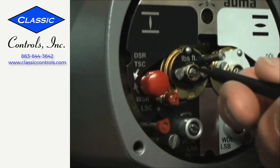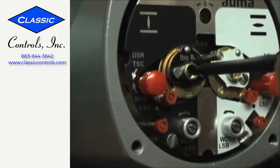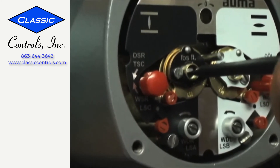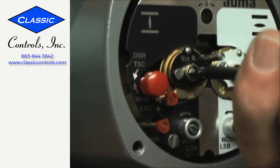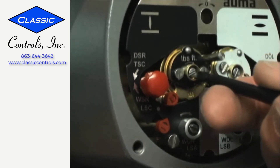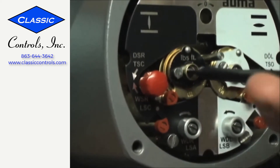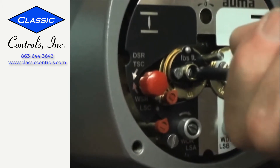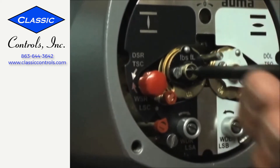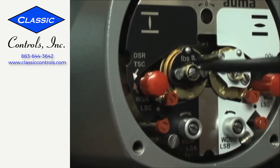I am going to push in and turn in the direction of the arrow. For every turn of the screwdriver, my pointer will rotate 90 degrees, and I'm going to bring it around just until it points towards the trip mark. If I should inadvertently go one or two clicks too far, just bring it all the way back around again, and immediately stop turning on the trip mark.